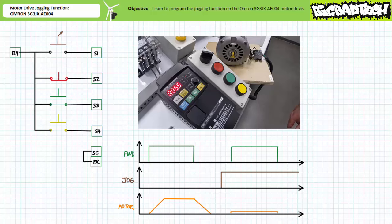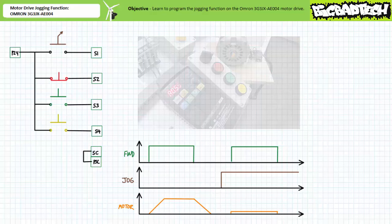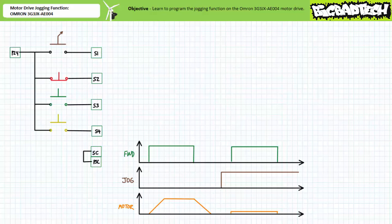As previously, the slow speed jogging event is followed by an immediate DC injection braking event. Only this time, DC injection braking lasts considerably longer. During the 6-second braking period, we can test the limited holding ability of the DC injection braking. Despite the fact I can turn the shaft, realize it's taking significant effort for me to do so. As soon as the extended DC injection braking period finishes, the shaft spins freely. Ordinarily, you wouldn't continue to apply DC injection braking for this long unless you were really desperate, but it's too cool of a phenomenon for me not to demonstrate it.